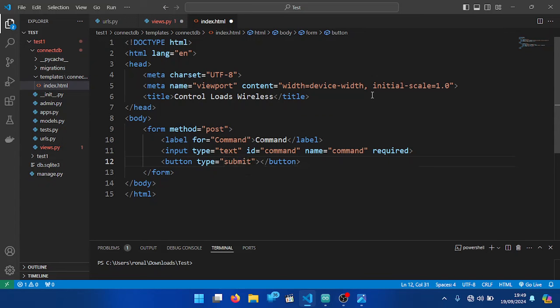In Arduino IDE, this is your new sketch. The first thing is to import libraries. In Arduino or C++, you use hash include to add the libraries, but you have to meet some very important prerequisites first. Come to File, then go to Preferences. This is very important actually. You have to add for ESP8266 some JSON file here.